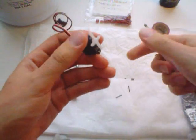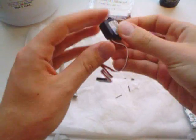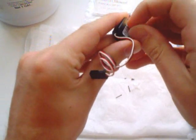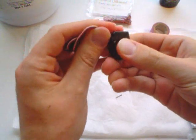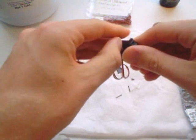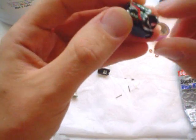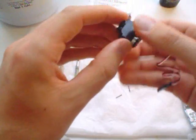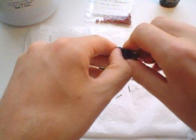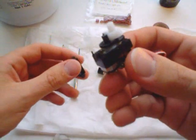This is the servo horn that will be removed, so you pull that off. There is also a sticker here that you need to take off as well. Remove that. Then you open up the bottom. What you will see here is the servo control board — it has an H-bridge and some control electronics right here, and the DC motor right here. You also want to remove the top as well. This is the gear housing.